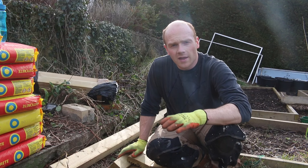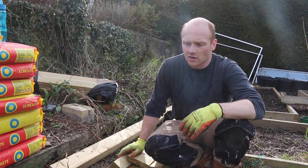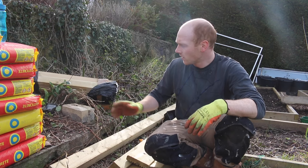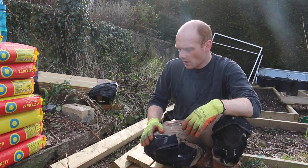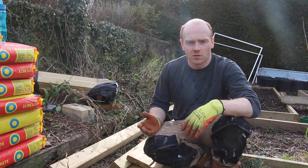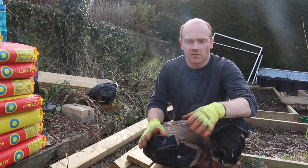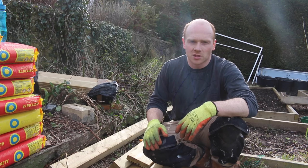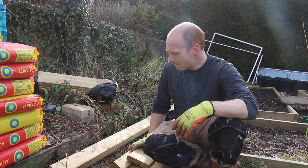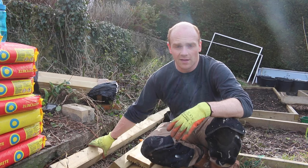Because we want a painted finish on the fence, or a coloured stain, we wanted smooth timber. So the pickets themselves are in a nice smooth plain finish, so it made sense to try and find smooth posts and rails. But actually most fencing stock is all really rough sawn, so it wouldn't really have matched up, and it'd be quite hard to paint as well. So I've got some structural timbers instead.